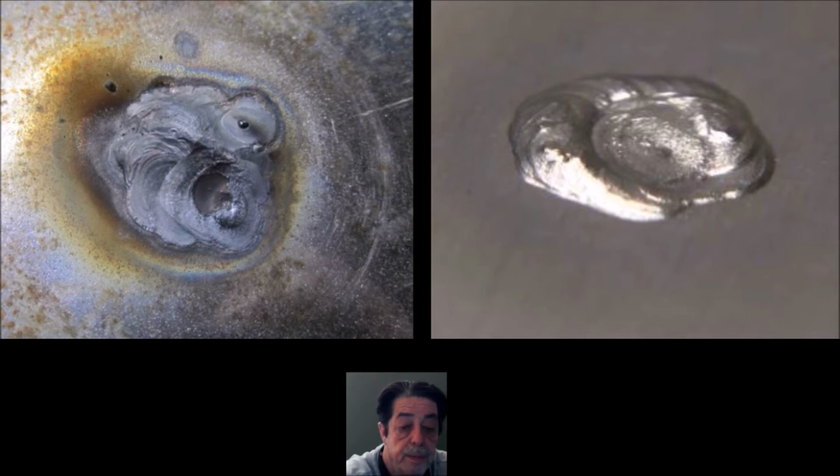And at that point, I just sand it down and I can make it look however I want. Paint it with primer. If I don't like it, I can come back, zap a couple more little zap welds, or it's just like flicking the trigger and just hitting it for a brief moment. And I can fill it in, grind it down, and I can still paint primer, and I can still make it look good. Okay, moving on to the questions.